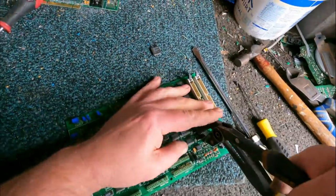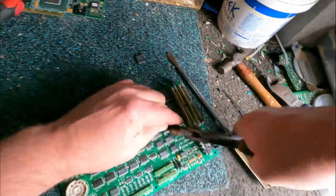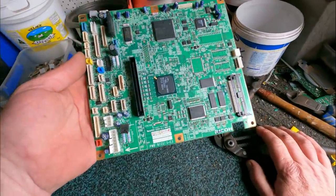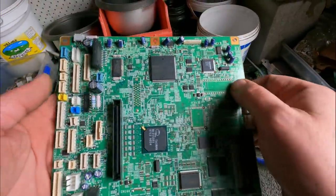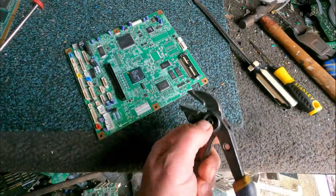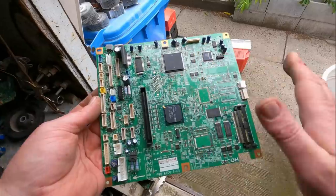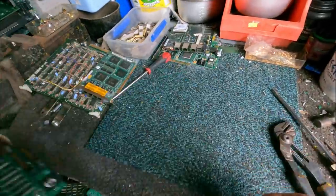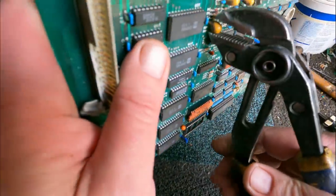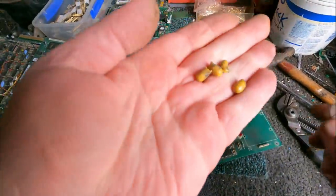Here's a very similar board. Here's the EEPROM that was missing on the last one. What I do - I skim off the sticker and I just want to look at the center. In this case I can see the bonding wires are gold, so it's a gold one. Most of the time - usually about 95% of the time - the bonding wires are only silver. So in this case I'd definitely take it. Sometimes I'll take the silver ones too, but sometimes I'd rather take off IC chips and leave a silver EEPROM on.